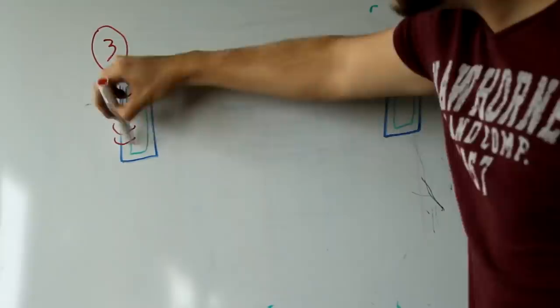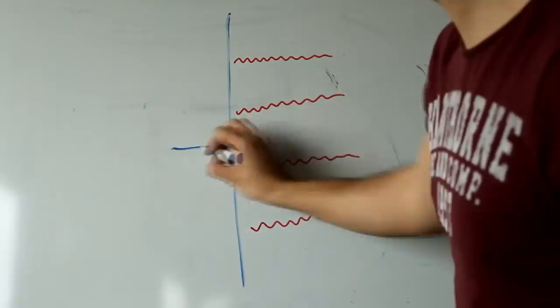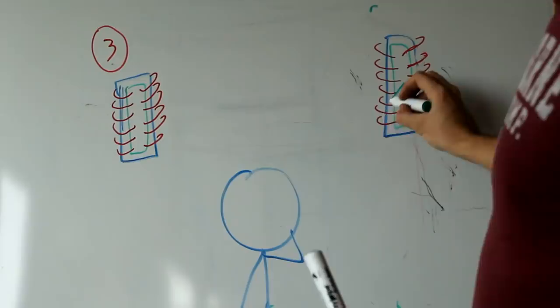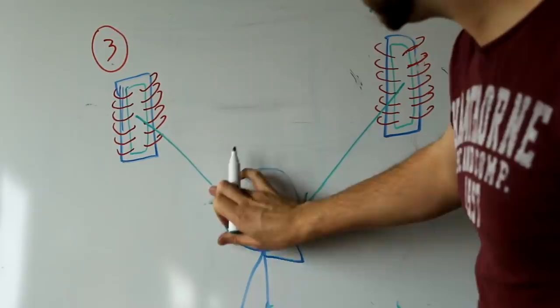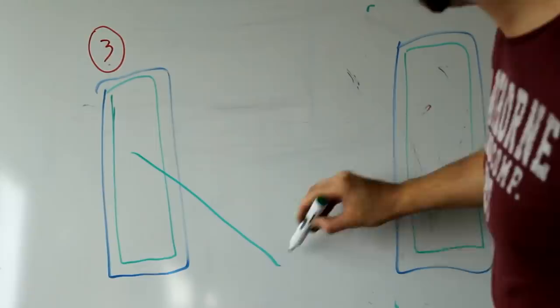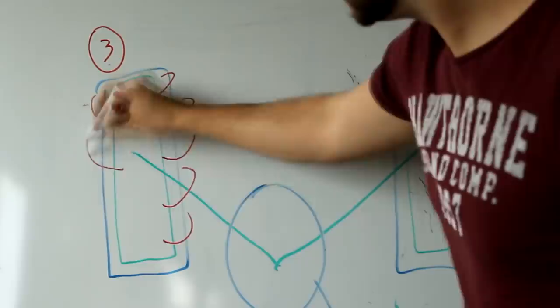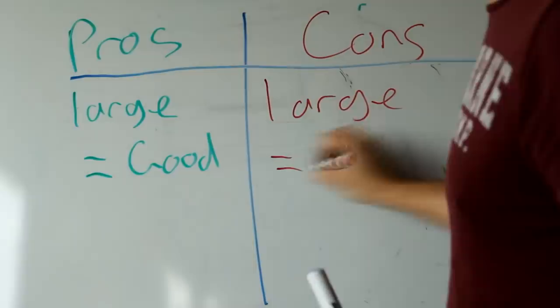And the last reason is treble dispersion can be a problem. I already mentioned that these speakers beam more than conventional drivers. When a sound has a wavelength that is small relative to the size of the speaker diaphragm producing it, so a small wavelength coming from a large surface that's vibrating, it tends to radiate over a narrow angle rather than dispersing widely into the room. And that means that the sweet spot for the listener to experience the full effect of the electrostatics is quite small, and simply moving your head to the left or right can dramatically change the high-end tonality and characteristics of the sound. This effect is made more and more apparent the larger the panel size, and since pretty much every other drawback of these speakers can be alleviated by making larger panels, this then becomes the main problem.